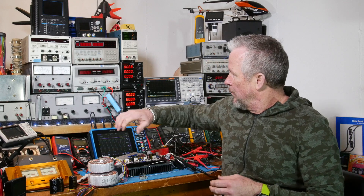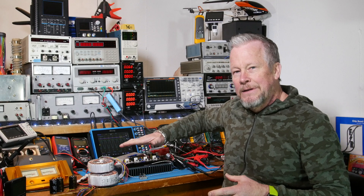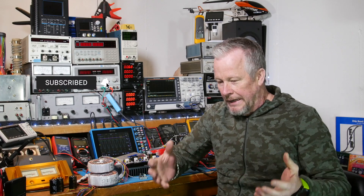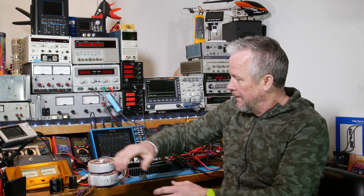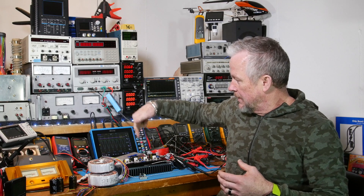What we're going to do today is look at the voltage on screen. Right now the bias current is set at just under half an amp, and the amp is getting pretty hot. I can go lower on bias before it starts affecting distortion. To keep it from getting too hot, I can select a transformer by looking at the voltage — seeing how low I can drop it before this starts to clip.